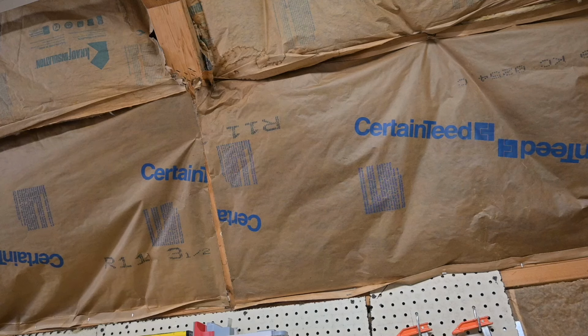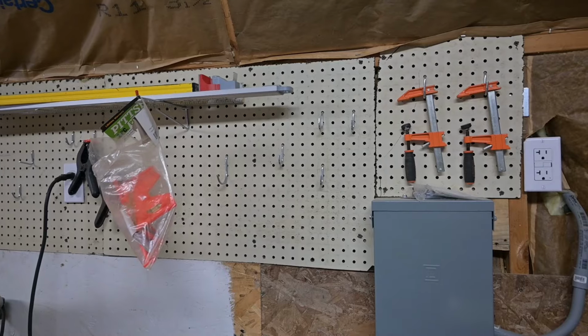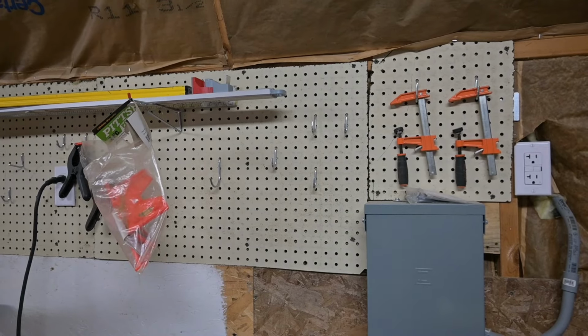Man, I'm so tired of leaky buildings. I didn't tell you guys, but I also discovered that the shed that I built out there, the little Mickey Mouse together one that used to be a shed in a box with a canvas tarp, and I covered it with metal, had a bunch of snow come in it too. I think because it has a ridge cap on it, the winds were blowing so bad that day that it was just blowing it in under the ridge cap.